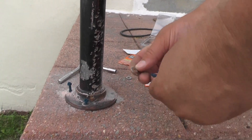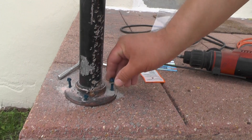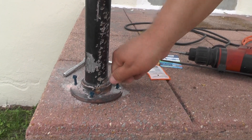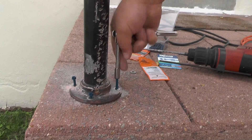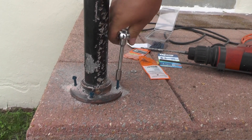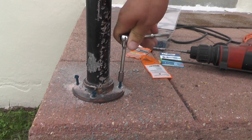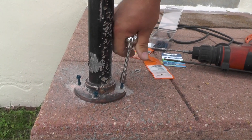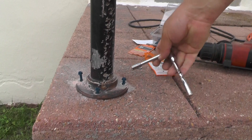Before I install it I'm going to use a stainless washer so it won't rust. Set that in, and then just tighten it down with this ratchet wrench. You want to make sure that you just snug these up — don't try and go too tight or else you can actually strip out the cement. Just bring it down until it gets snug and you'll be good to go.